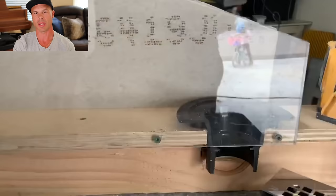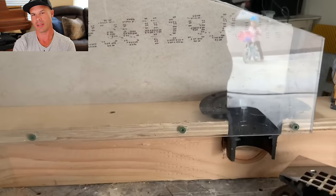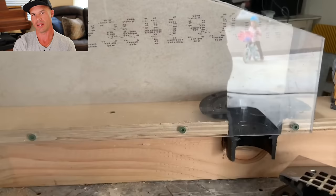For the pre-slope, if you're using deck mud, half inch is probably okay. If you were doing it as a full float, then you probably want more than that — at least three quarters. But for pre-slope, half inch is probably okay.